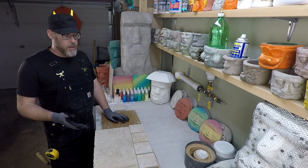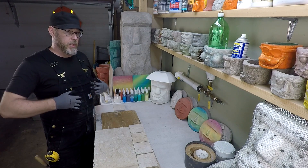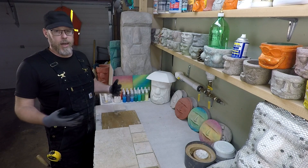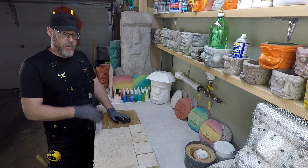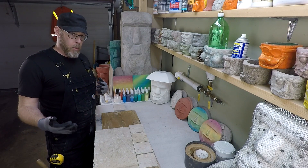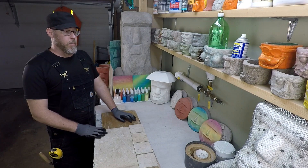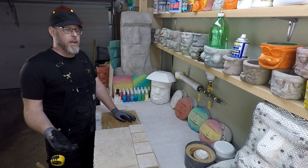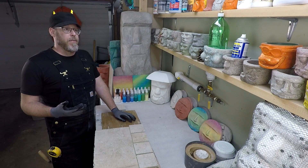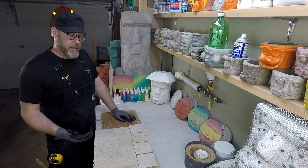So the first thing to consider is that perhaps your subfloors aren't meeting deflection standards. As a result, regular use of the home and foot traffic is causing enough deflection that the tile is absorbing more forces than it was intended to absorb. To that extent, let's talk about the tile itself for a second — there is going to be a certain amount of force transfer which ultimately reaches the tile.